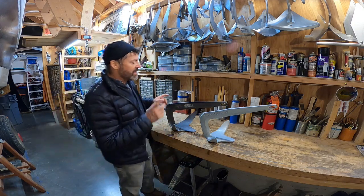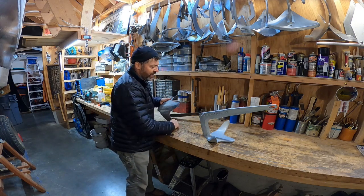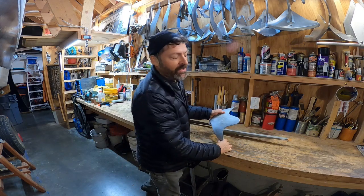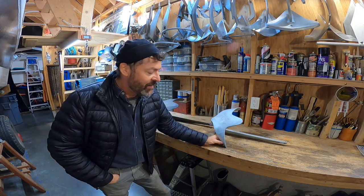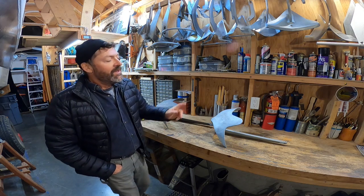You might also ask, what about the setting tip weight? And they are very, very similar. Both anchors are right in the low 30s. The claw is actually a little better. It had 34% of its weight on the tip in this position, where the Bruce is 33%.